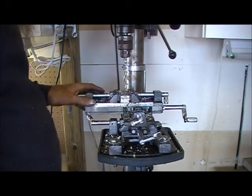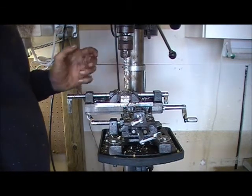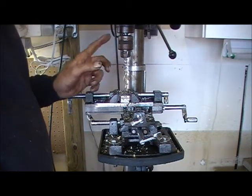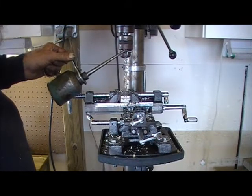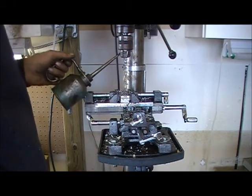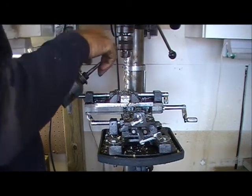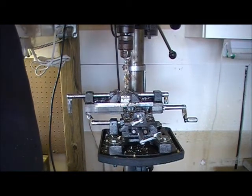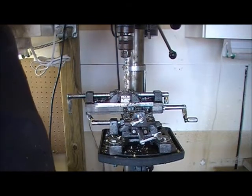If you've got an automatic oil pump or something, just take your piece of bar stock and hold it up there — but do it so you're not gonna wipe yourself. Use the edge and make sure it's not gonna catch the teeth. Put it on the back side, away from the rotation, so the angle doesn't catch and jam it into your hand. That's helpful hint number god-knows-what.